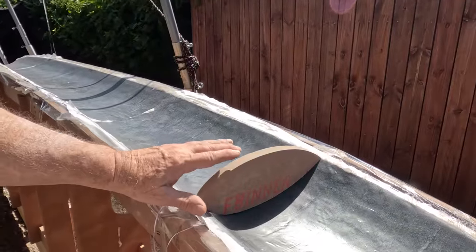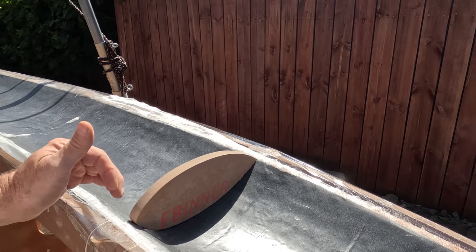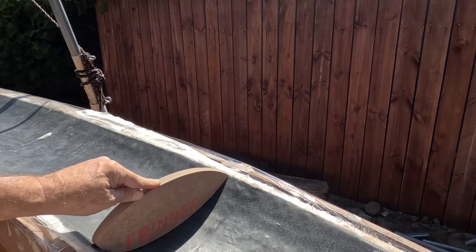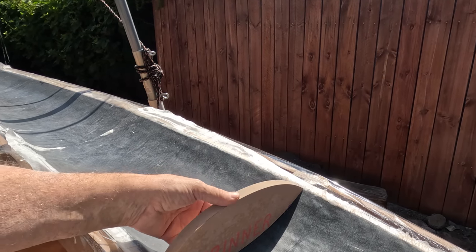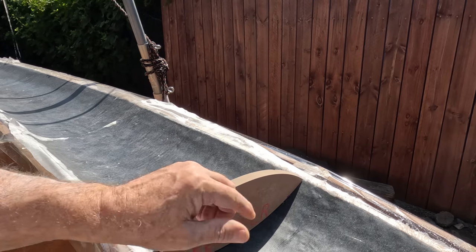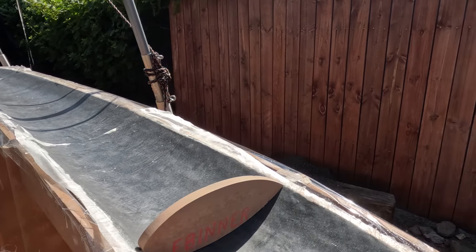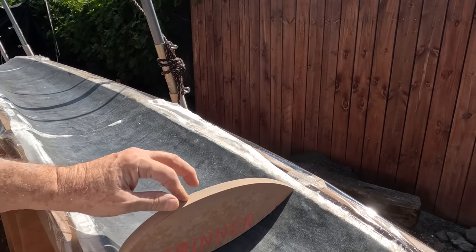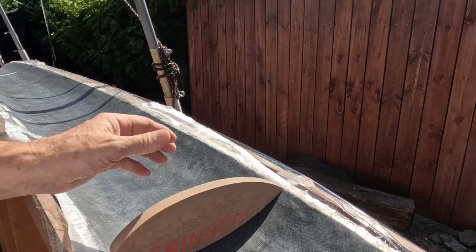the next thing up is to put in these forms that go across here so that we can put our new strips across there, which we want to get to this week. So what we tried doing here, we're just testing on this one, and it seems to be holding, is used Elmer's glue. The reason we used Elmer's glue, right on the peel ply, is that it hardens up, but it's water soluble later.